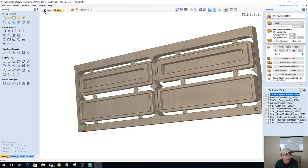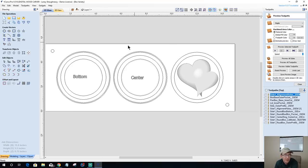Now, these are just two shapes of many shapes that we could do. Imagine if this box had a heart shape. It's the same concept. The only difference with a heart shape on your offsets is you have to use radiuses at the bottom of the heart. That sharp point's not gonna cut it. Make the bottom of the heart box a little bit wider and rounder. It doesn't have to be a heart box, but I'm just giving you an example.